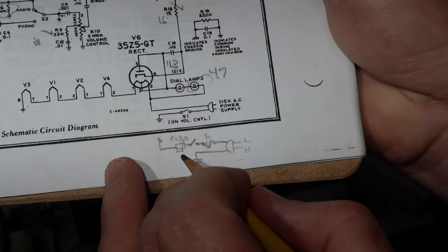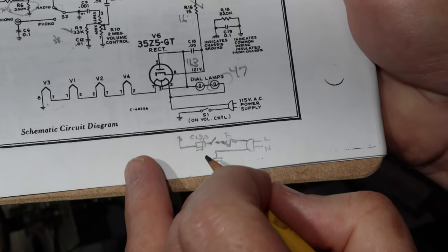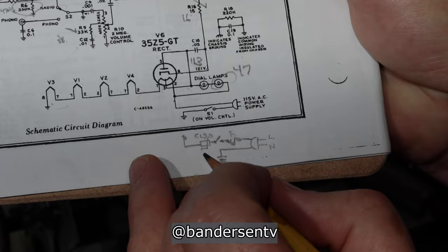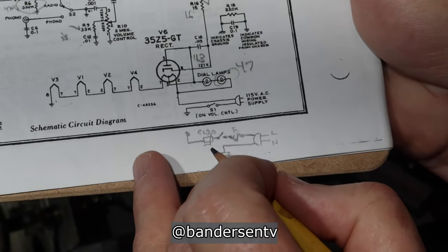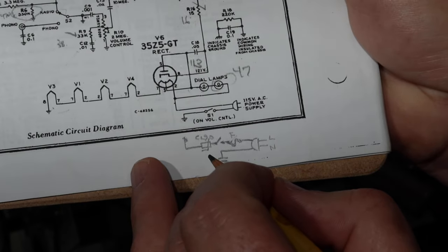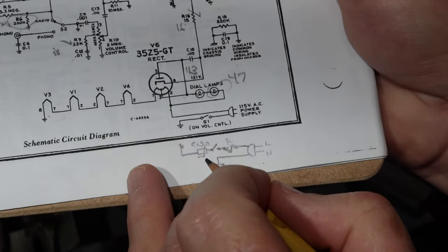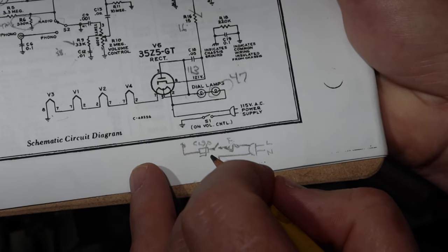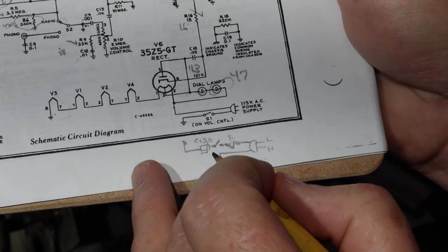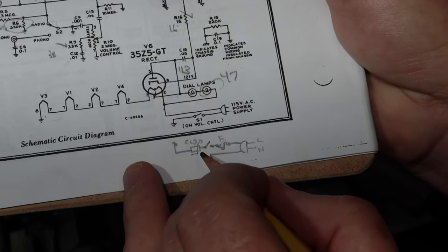So, as far as CL90 goes, I've seen some people talk about ones to use here. Recently, Bob Anderson was talking about the use of these in, like, Philco television sets. He's by every means possible more of an expert than me on these things. But the Philcos were designed to have a thermistor in them. So to match the characteristics of it, particularly in terms of the currents and so forth, I would think would be pretty critical.